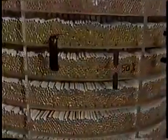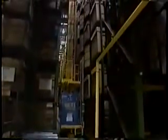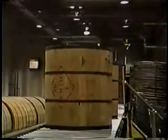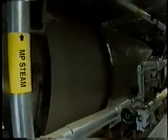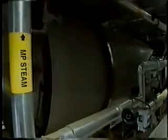Depending on which brand of cigarette is to be produced, the amount of each component to be used is selected by computer based on leaf department formulation. The bright and burley lamina, RL, BL, and Oriental tobaccos are individually conditioned with steam to increase moisture and temperature to reduce breakage. The leaf separation process is continued in the feeders and air separators. The bright and Oriental tobaccos are mixed and a leaf dressing is applied, consisting of humectants and flavors. The burley lamina has a similar flavor spray applied, including humectants, sugar, chocolate, and licorice, and then it is re-dried. An additional specific burley dressing is applied.